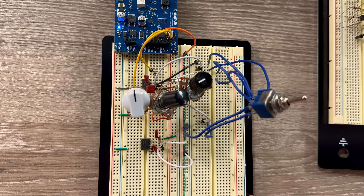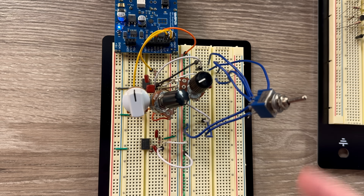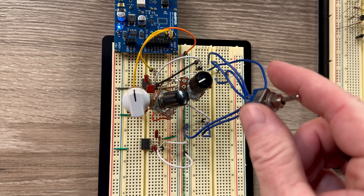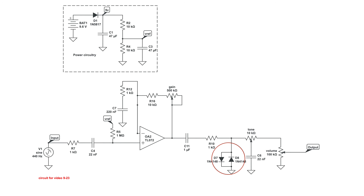What you'll see right here is basically a breadboard, and I have a very simple distortion circuit. I'll show you all the schematics in just a minute, but a very simple distortion circuit - just a non-inverting op amp, some clipping diodes after, a very simple tone control. I have this little switch here. This is going to change it from soft to hard clipping. Basically, soft clipping would be more like an overdrive. Hard clipping would be more like a distortion.